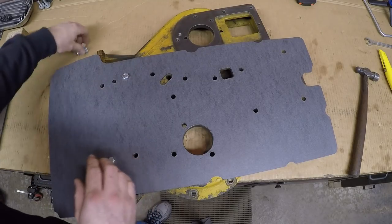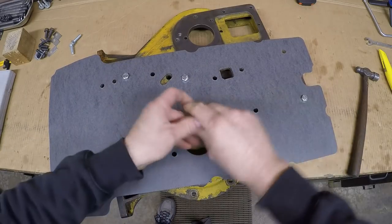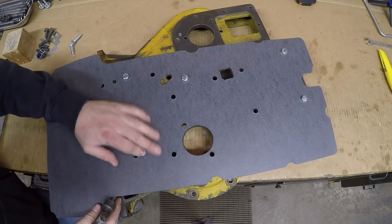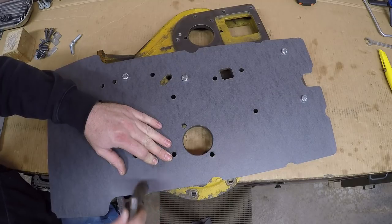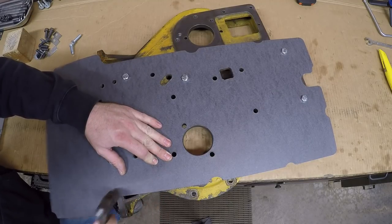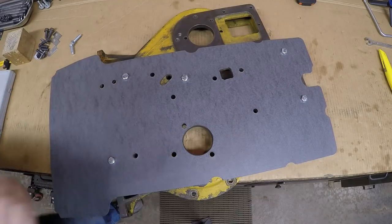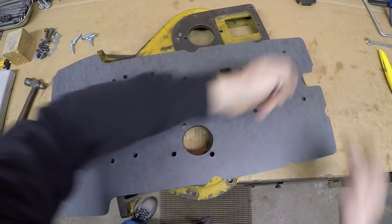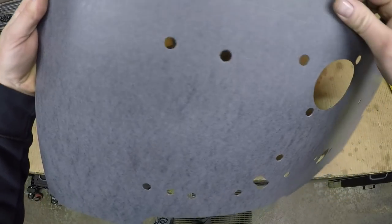So, as usual, we just drop some bolts in, hold everything from migrating around, and we'll just start with a machined edge. Find it right there. Just start going down, making a line, creating that witness mark, and it's just like for the bolt holes. Put it over here. You can usually see a pretty clear mark that you've got going around there.